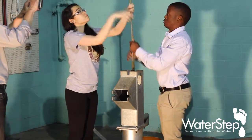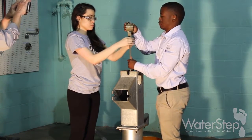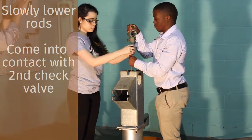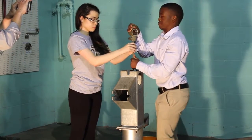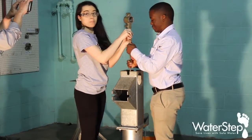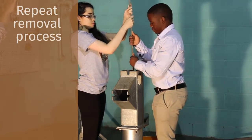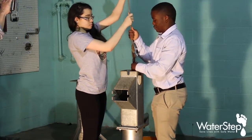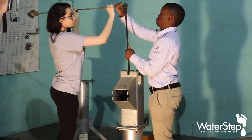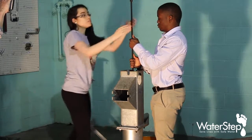You may need to rotate the sucker rods a little bit until you feel it drop into the loop and you can capture it. As you put the last sucker rod on, slowly lower it until you feel it come into contact with that lower check valve. Then you may need to rotate it a little bit, and then you can lift up on it — you will know that you have caught it because you'll feel it pop up. Both people putting their hands on, you bring it all the way up until you clear the cylinders. Then you just remove the sucker rods one piece at a time, being sure to always hold on to them because you don't want to drop those down the well.